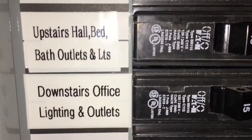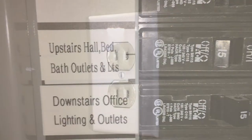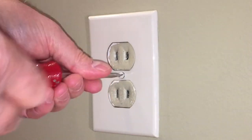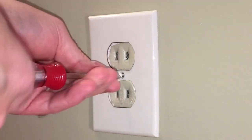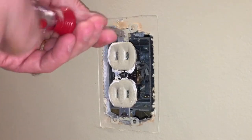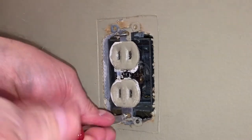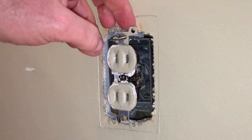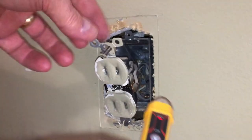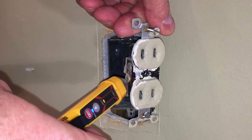Okay folks, let's get this repair underway. First thing we have to do is secure the circuit breaker. Once that circuit breaker is secured we can remove the face plate on the outlet. Next we want to unscrew the outlet from the outlet box or the wall, but I still want to be careful — I want to ensure that I secured power at the breaker and I'll do that with my circuit tester.